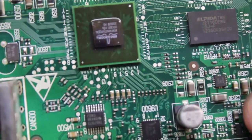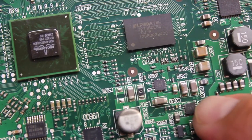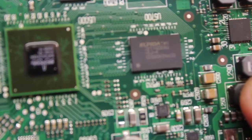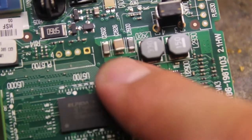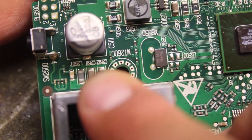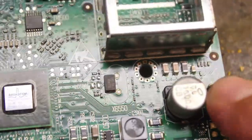Make sure that you're taking the time to look and make sure that it is a monolithic ceramic capacitor and not just start destroying the board. Just because you see little squares doesn't mean they're all going to be the same value. For example, here's some more C's — prime example here. Somebody would probably just take all three of these off. But see, there's two in a row and that third one there is an L. People would just take all that off and not know that that last one is going to devalue your stash.